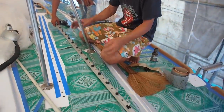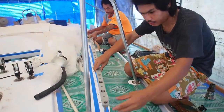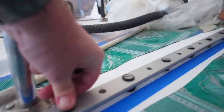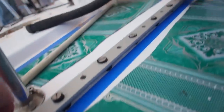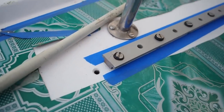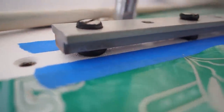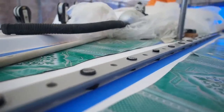We've done all the fiddly bits now. The next fiddly bit is getting it all lined up. Obviously we're going to have some overspill — we were quite liberal with the tape. It's pretty cheap stuff and you can wipe away the excess with white spirit, but we just want to make sure we've got those countersunk holes fully covered. We'll push it down a little bit more and then go underneath and start applying the nuts and backing plates.